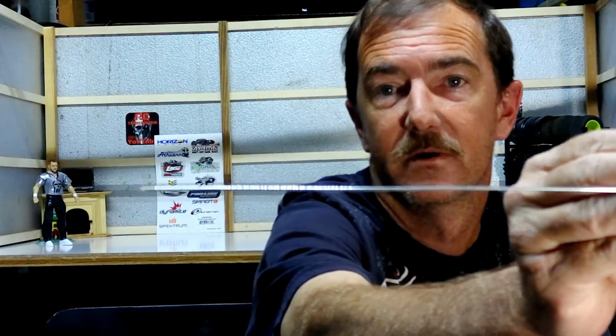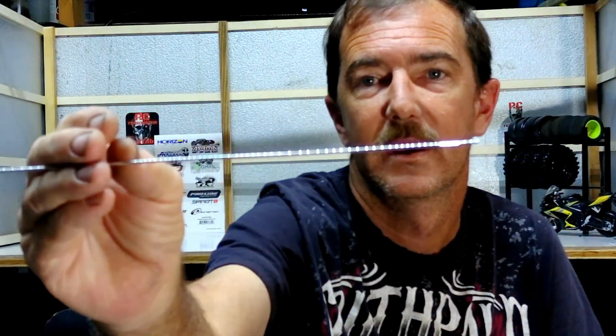As you can see, we kind of had ourselves a little issue with some of the brazing rods. They state it's brazing rod, but I ordered 100 of these off of eBay, and it says brazing rod for aluminum with flux. And I'll tell you what, it ain't. It's TIG. These are TIG wire. Kind of hard to braze with TIG. So I brought this up to a friend of mine at work, and we went ahead and got it brazed up, as you guys seen. Definitely a learning curve.